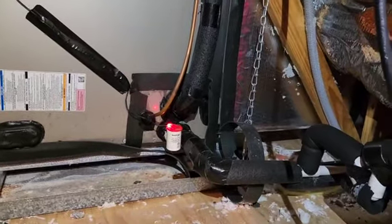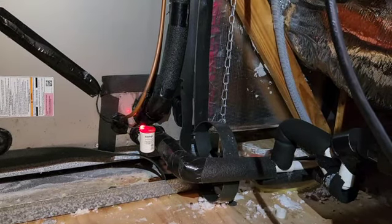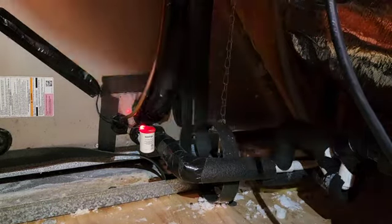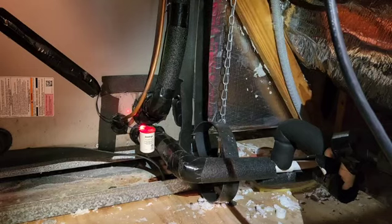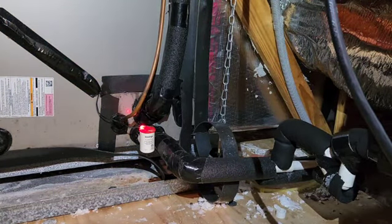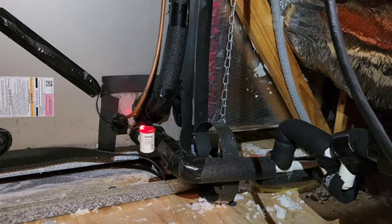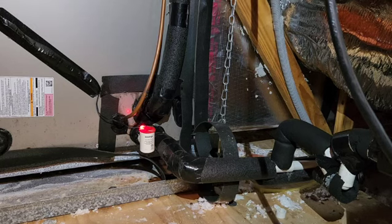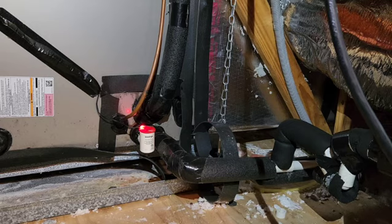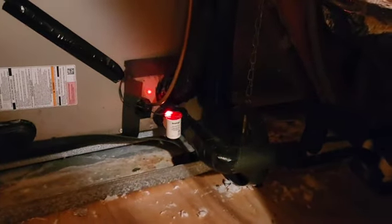The first thing I noticed was there was this red light on. I've had several air conditioning units across multiple homes in my life and I've never seen this before — I think it's a great idea. This is an overflow float switch, a safety overflow float switch, that if there's too much condensation going on inside the air handler, it'll trip the switch. It's kind of like a bilge pump on a boat: when there's enough water, it turns on the pump. In this case, if there's too much water, it turns off the air conditioning unit. There's a light on this device to tell us that it's tripped — otherwise I'd be guessing.